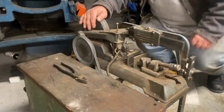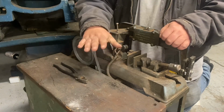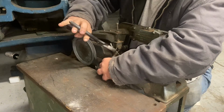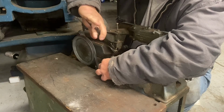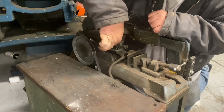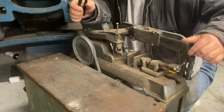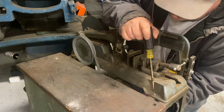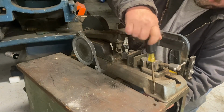Okay, start cutting the old plug off for the switch, and yes, it is unplugged. Typically I replace all the wiring on old stuff like this anyway. And this is an on-off switch. We click it once for on and second time for off, so it's about the least desirable switch you'd want on something like this. The rest of this, hold on, some screws and some nuts, square nuts it feels like.